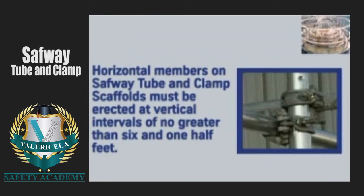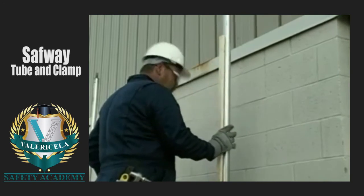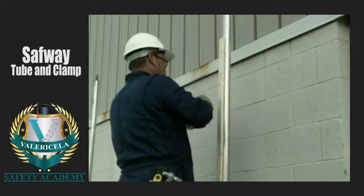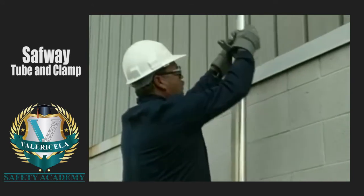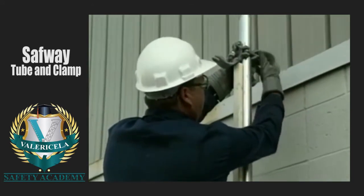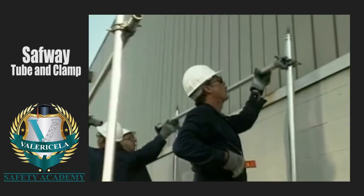So, begin by measuring from the bottom of the runner clamps on the first level of runners and mark the post at 6 1/2 feet. This mark is the position of the bottom of the clamps for the next level of runners. Or use a pre-cut 6-foot 4-inch measuring stick. A 1x2 works well. The measuring stick will set the proper distance from the top of the lower runner to the bottom of the runner at the next level.